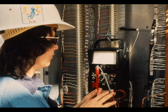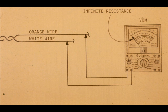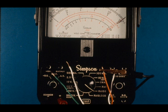Check the wire pairs for shorts to ground. Put your VOM on R times 10K, or the meter's highest resistance range. Attach one VOM lead to ground, then check each wire. The meter must indicate one megaohm or greater resistance between any wire and ground. There must also be one megaohm or greater resistance between the wire pairs.